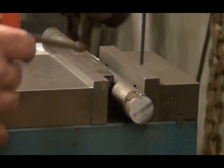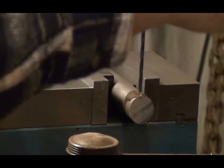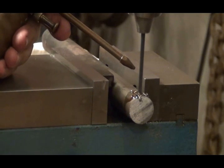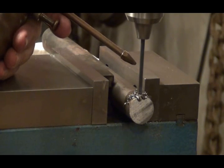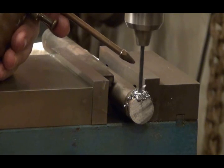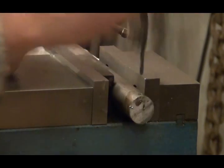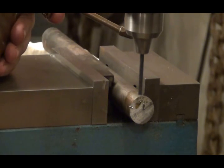Got my little Eagle Oiler. I'm going to go way down through to make a hole here, making sure I get plenty of threads so I'm threaded at least to where the half-inch hole will be, so I don't have to switch to a bottoming tap.